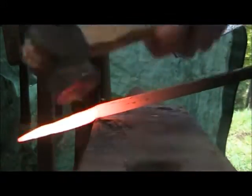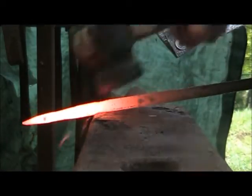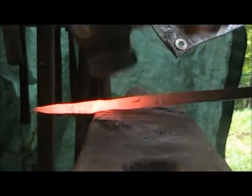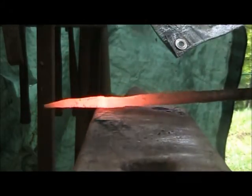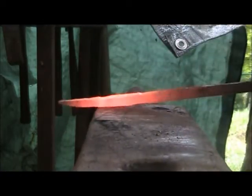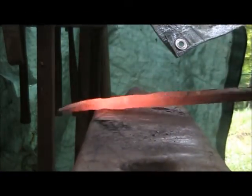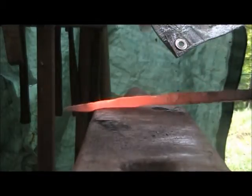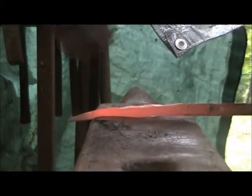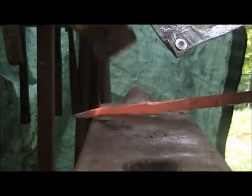If you notice during my taper, what I'm doing is I'm rolling the material — I'm kind of necking it almost. Each little hump I make every time I hit it on the edge of the anvil, I whack down with my next hit. It draws it out really fast and it's pretty easy to do. Keep that in mind when you're drawing out a long piece or something that's going to take a while.